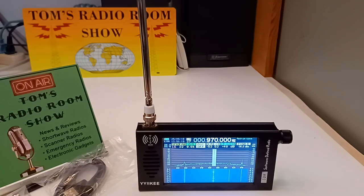Here are the specs on the frequencies: 100 kHz to 149 MHz, with a minimum tuning step of 1 Hz. The modes are CW, lower sideband, upper sideband, AM, wide FM, stereo, and an IQ mode. The IQ mode rings a bell, but I can't quite remember where that comes into play.